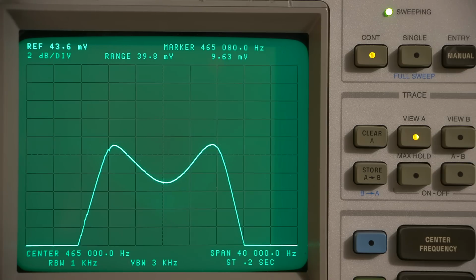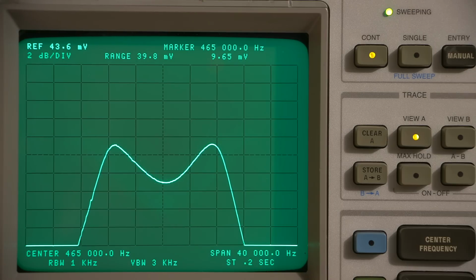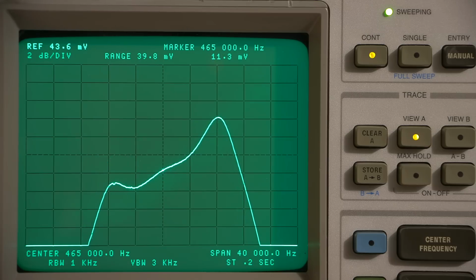So what I'll do is I'll give you an example. I'll just move this back to the center here again, so it's right at the center. If I just push on one of those capacitors with a screwdriver, watch what happens to the pattern here, okay? So I'll just get over here, and I'll put a screwdriver on the capacitor, and I'll just press on it. See that? Now, if I was to give this a twist of a hair's width, we'll say maybe a millimeter, look at that pattern. The pattern is immediately destroyed. We're talking moving that a hair's width.